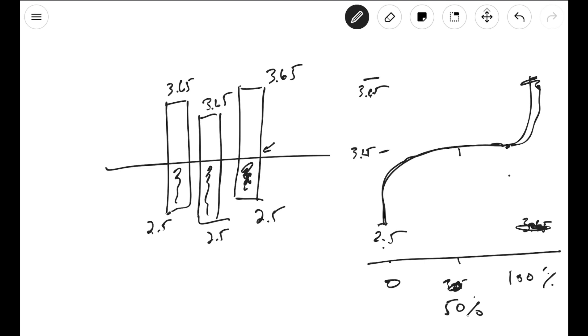So that's the voltage curve. Here we have three cells wired in series into a battery. When we first start, we haven't balanced these cells — we've just got them from the factory. We go in and observe the voltage from this line. We might see for the first cell something like 3.29, then something like 3.35, and then something like 3.25. We think: the biggest gap between any two cells is just 100 millivolts difference — they're pretty balanced, let's just use them as is.